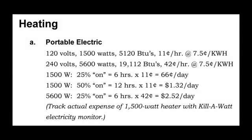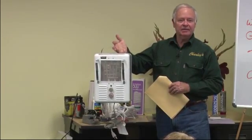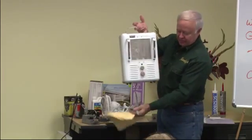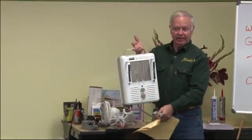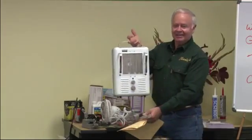We get into the winter months and talk about heaters. Your portable electric heaters — a BTU is a BTU regardless of what type of heater it comes out of. So electric heaters are 100% efficient, and this heater will produce the same number of BTUs for $60 as a $200 heater. The difference is how long it will last, the quality of the thermostat, and whether it's grounded. Beware of small, inexpensive heaters that don't have a grounding plug — you need to ground everything in the greenhouse.